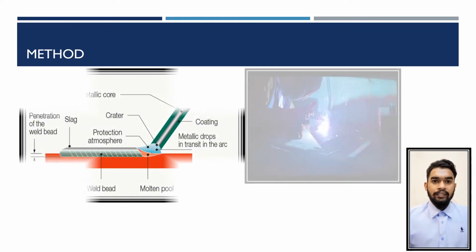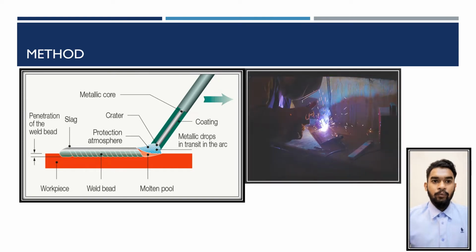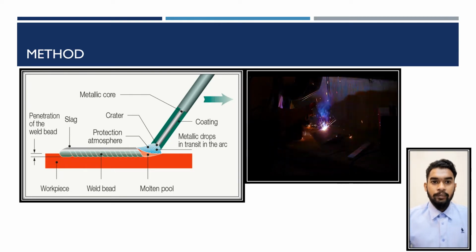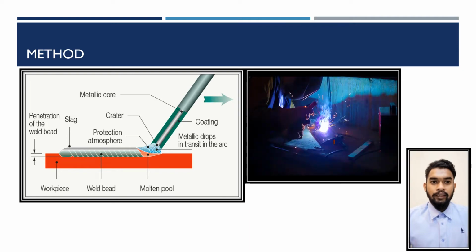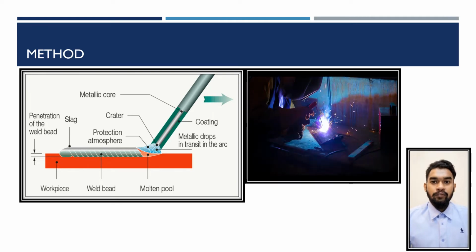Porosity is caused by gas in the weld that did not escape before the metal solidified, leaving the weld weak due to gas bubbles. Therefore, adopt a slow travel speed to keep the puddle molten and enable gases to bubble out, resulting in a powerful weld. If you are welding thinner stock between 10 to 18 gauge, set your work at a 45 to 75 degree slant for the quickest travel, and don't make the junction too broad or you'll risk burn through.